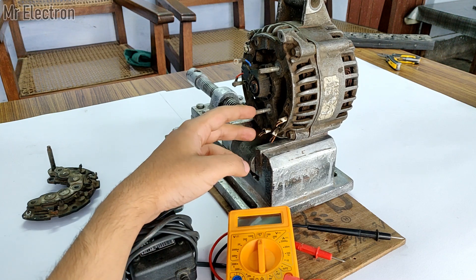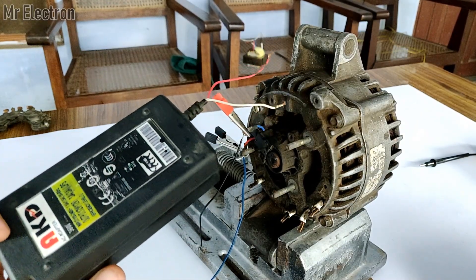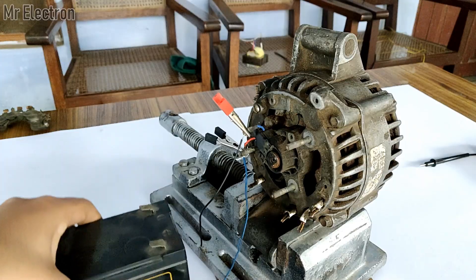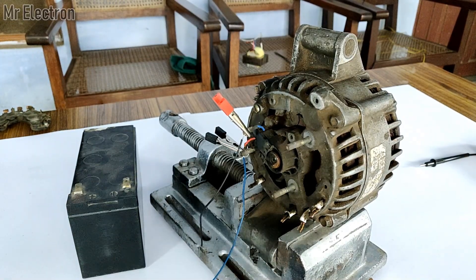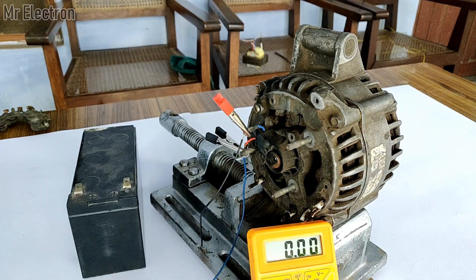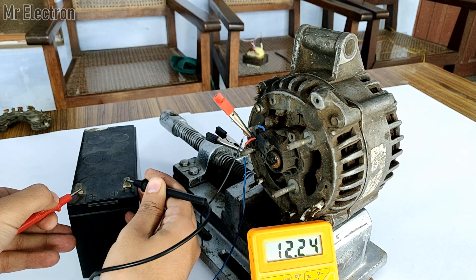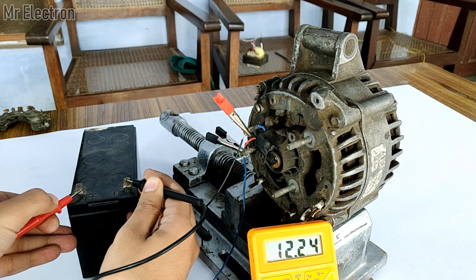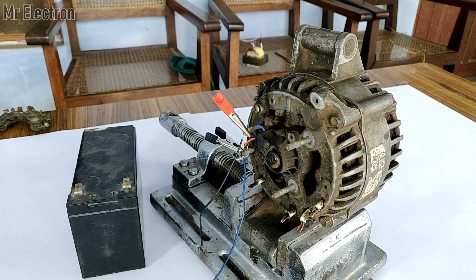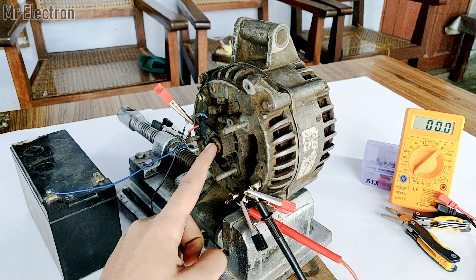This adapter is not working, so instead I am going to use a 12V UPS battery. I'll show you — the voltage of the battery is 12.24V, which appears charged. However, as soon as I connect a load, the voltage will fall down to around 6 or 7V DC. I have connected the positive terminal of the rotor brush to the positive terminal of the battery, with the negative terminal still left open.